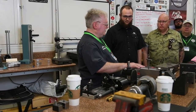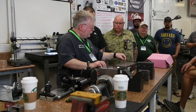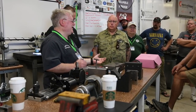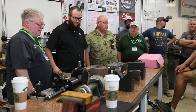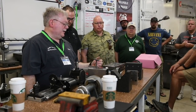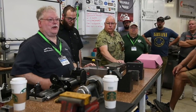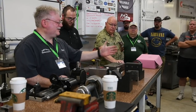Your magnet - some of you may have seen Stan's video where he takes squares with lips on them and modified this magnet so he can set them down and grind. That was a very clever idea. Your support tooling depends on what you're doing. If you had just one set of squares to do, you wouldn't cut a slot in the magnet, but if you're doing a production run, it's worth the investment. Granites are more for your checking - they're probably a lot more accurate than what I have and work great for checking your work, but obviously you can't stick granite on a surface grinder magnet.